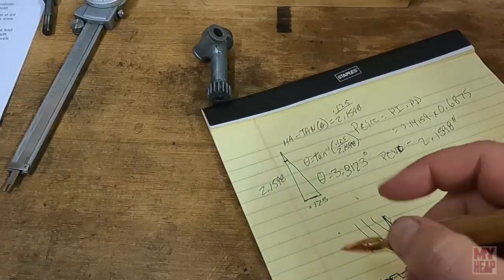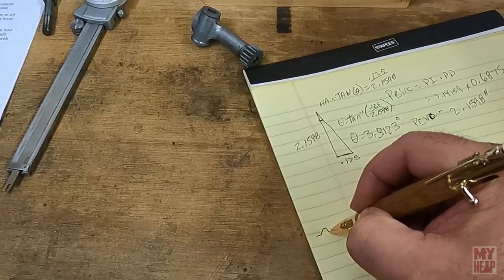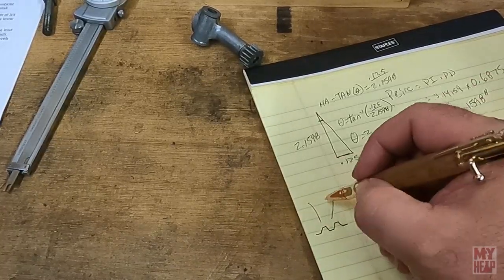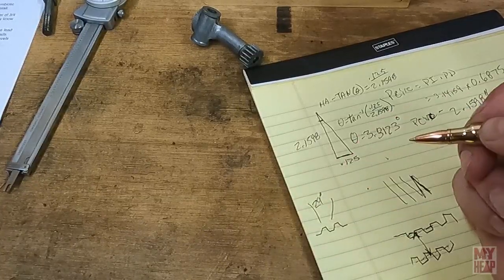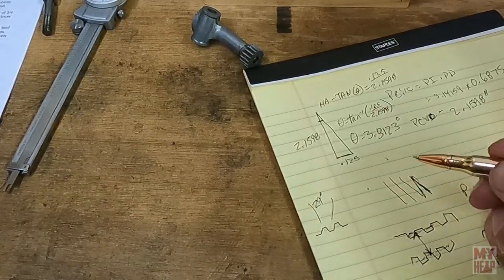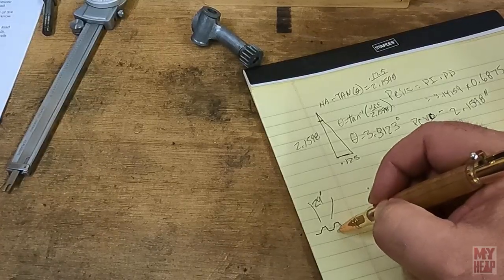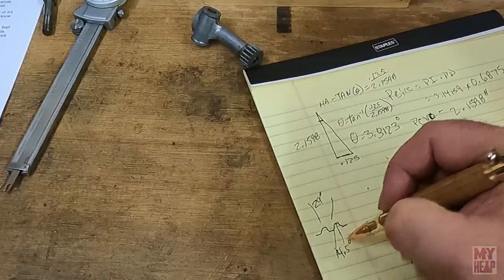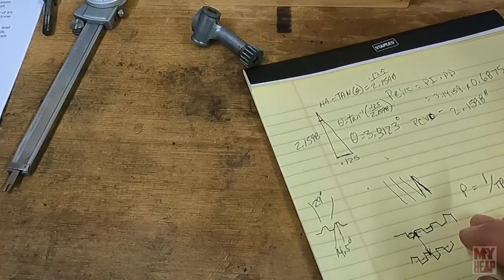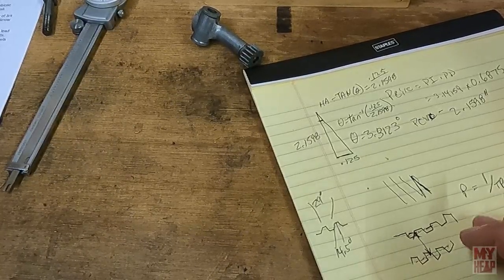The last thing I want to mention is the angle of the Acme thread. When you look at an Acme thread, the included angle is 29 degrees. If you look at it in profile like a rack, the pressure angle is half of the included angle — so half of 29 degrees is 14.5 degrees. That number should look familiar because it's a common pressure angle for involute gears on machinery of this period. So I think we've determined all the information needed to figure out the thread gear.